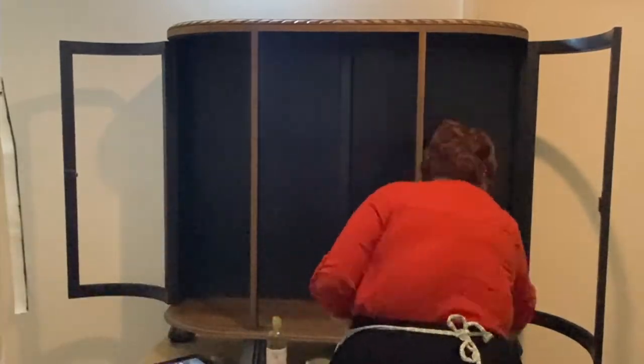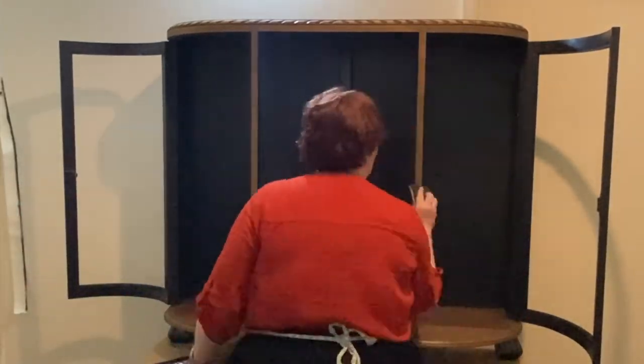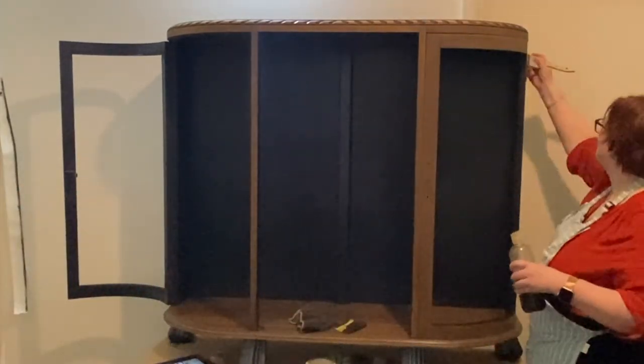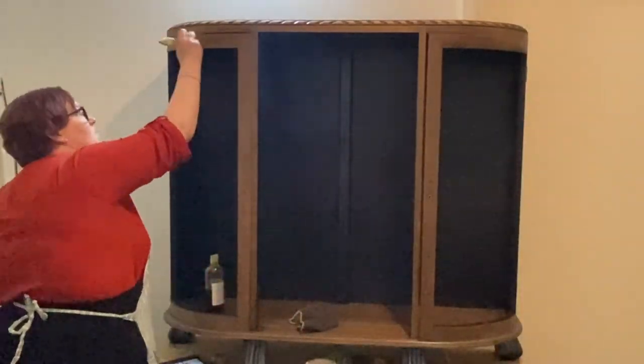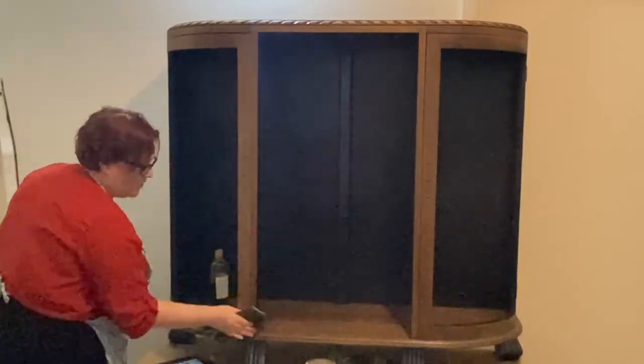The Stain and Glaze has a built-in top coat. It does not need to be sealed, but it is ultra, ultra matte. So the hemp oil, I find, just helps lift that timber that little bit more, and just hydrates it that little bit as well. So it's my favorite way to finish over the Stain and Glaze.